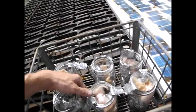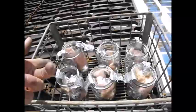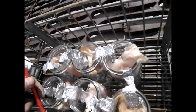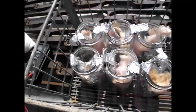Before I put the electrolyte in, I'm going to go ahead and solder up the terminals on each plate. The plates are going to be chained together in series - these two are hooked together, these two, these two, and so on. I've just soldered them all together. Now I'm doing a quick check to make sure none of the cells are shorting out.